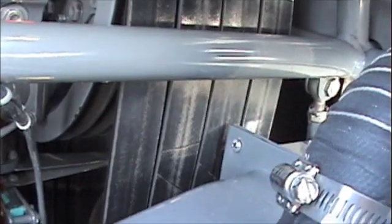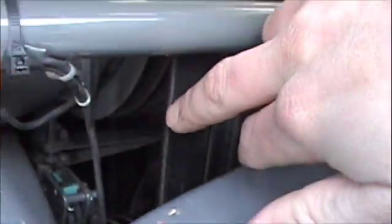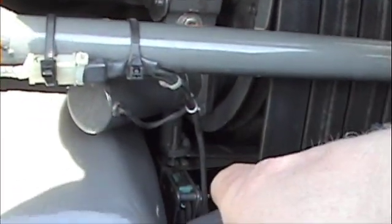You're checking for any separation in the belts. Each one, as you're turning them, you're looking for the bottom line. See this belt? There's a bottom line. You're checking each one of these belts as you're turning for the bottom line. Make sure the belts are not coming apart. You're going to be checking on the opposite side, which you cannot see — you'll need a flashlight. You're going to be looking down in the black hole across to the inside of the belt on the other side.